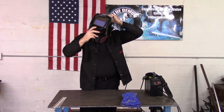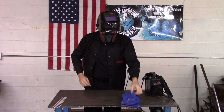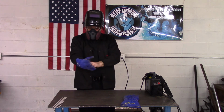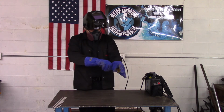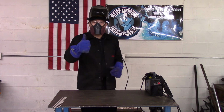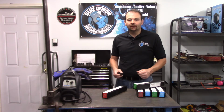Here's a tip. Many welders will wear a small respirator, like the one seen here. It filters out some of the harmful things floating in the air. The other thing it does is direct the hot air you breathe down and out of your hood. If you've ever welded before, you know the lens can become so fogged you can't see anything.